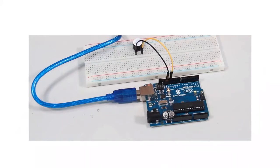Two ways. One, when you get the buzzer, there is a small sticker on top of the buzzer, and that sticker corresponds to one of the pins. You'll see a plus on that sticker. If it's not on the sticker, when you remove the sticker, even on the board itself, you'll find the plus. I'll be showing you mine through the camera shortly, so that you're able to see these stickers and how we determine the polarity of the buzzer. Otherwise, some of them are very hard to know.